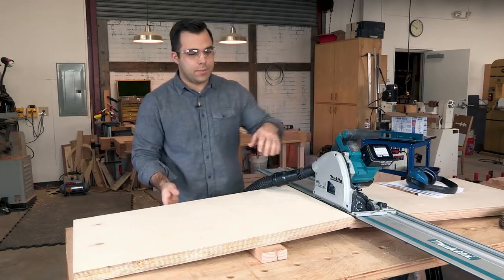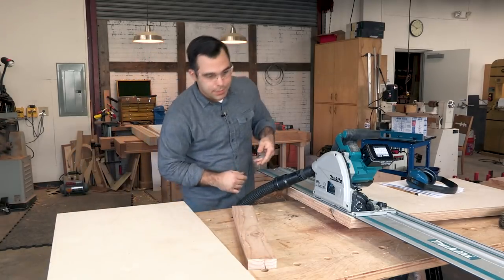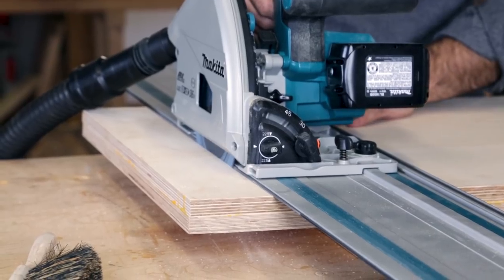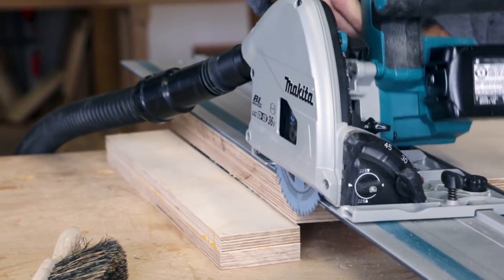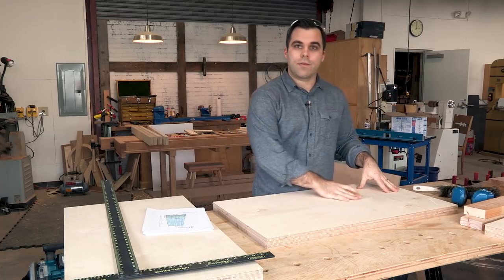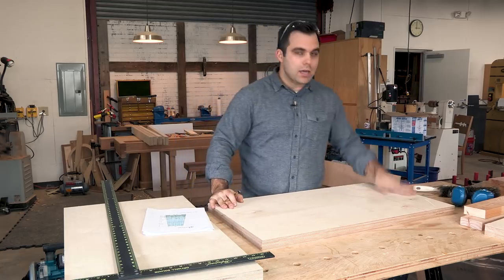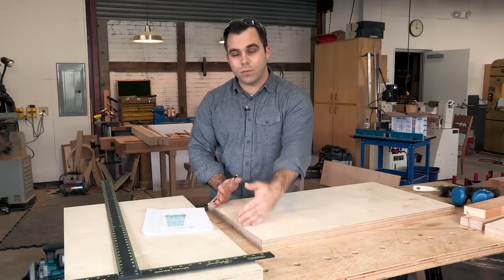All right, so this is going to be the main leg on the left or right side once I decide about that. And now I need to dimension the other half to 33 1/8. Okay, so we have our two legs dimensioned out to their overall dimensions. Now, these legs taper in a little bit, and so the bottom is at 18 7/8, and that's how I glued it up. The top is 13 inches wide, which is what Alan used.